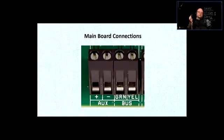Now, when it comes to something like a motion sensor, a motion sensor is a device that requires power to operate. It is going to give you an open or closed contact, but based on some condition. You need to have some sort of electronic circuitry to sense the motion in the room or in close proximity to it. Usually you have the motion sensors inside the room. It's very rarely you're going to have motion sensors mounted on the outside because there's motion happening all the time. There are animals walking, birds flying, and whatnot.